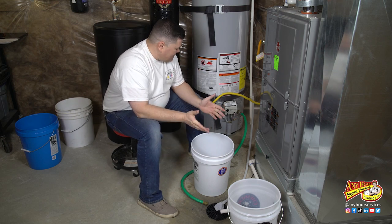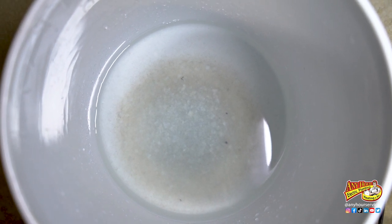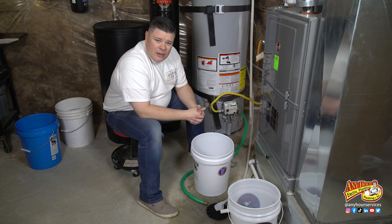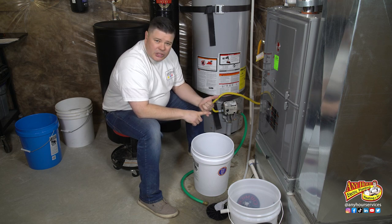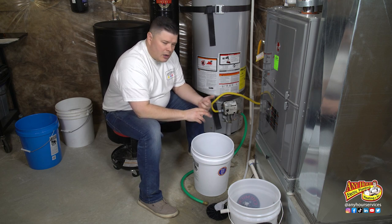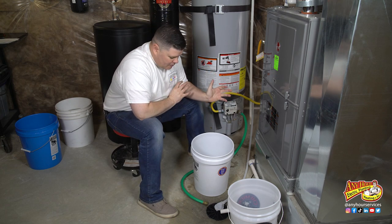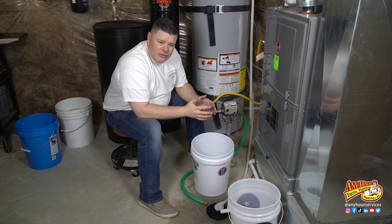This water heater is only about three years old and it's not in bad shape, but with the amount of sediment we pulled out of it, if you were to go another two, three, four years with the same amount of sand and dirt collecting in the bottom, over time it builds up. The burner for this water heater is on the bottom, so you're building up a thicker layer of insulation making it that much harder for the water heater to work efficiently. Down the line you could end up with a water heater that doesn't feel like it's making as much hot water — you might feel like you're running out faster. All of these are signs that you could have buildup in your water heater stopping it from working. If I had to pick, I would say the thorough drain and flush is the one I would prefer to do.